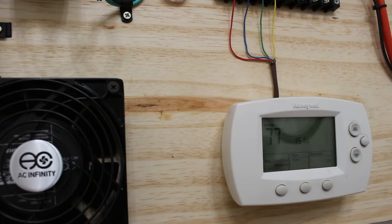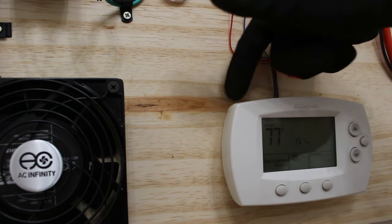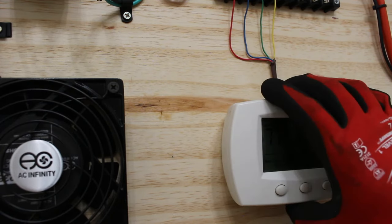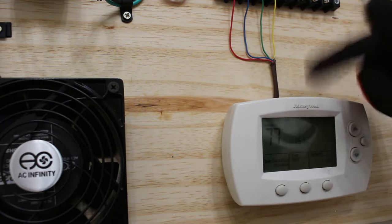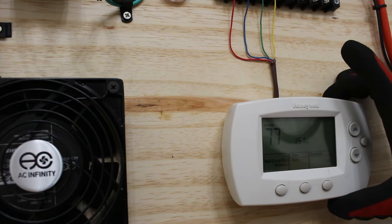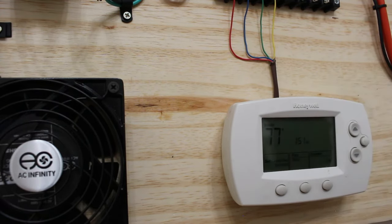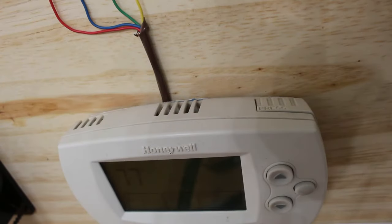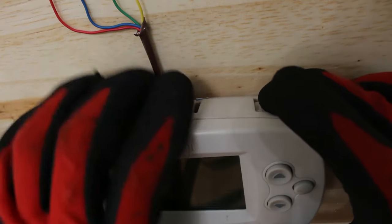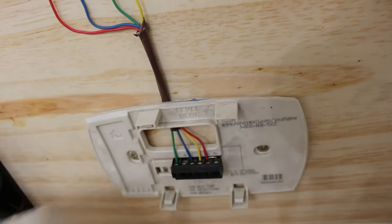It's fairly simple to take off the face plate of any thermostat. Typically, you can just pull off the face, but I always advise to take a look around because you might see an indication of how that one opens specifically. In this case, on the top right corner, there is an indication that says press, so you would press that and then pull. Here's the top right of the thermostat. Over here it says press, so you would press and pull the plate, and that comes right off.